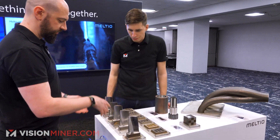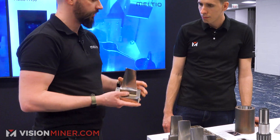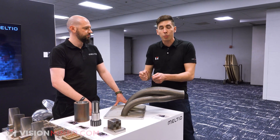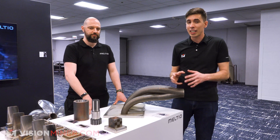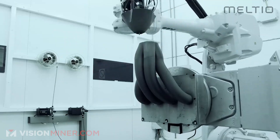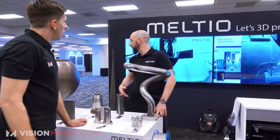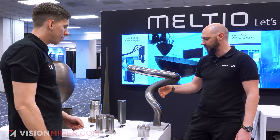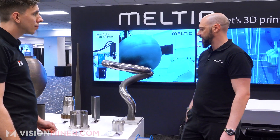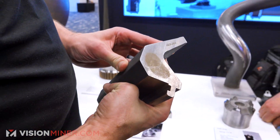These are the same part in different materials — from mild steel to Inconel, stainless steel, tool steel, and titanium. 3D printing headers avoids welding all those sections together, and you can actually use 3D printing for welding jigs — a lot of guys use jigs for cutting and holding custom designs to speed up welding. This part is 316 — could be done in 308 or Inconel for very high temp. The robotic arm integration allows constantly changing curvature, making parts not possible with any other process. This is a press brake tool made out of H11 tool steel with a core of mild steel to save on material.